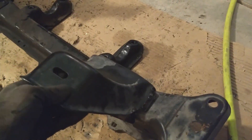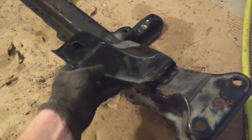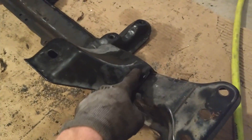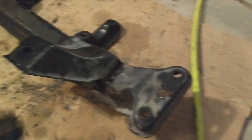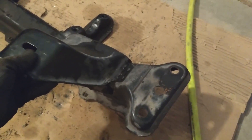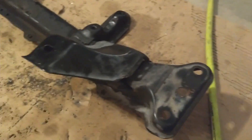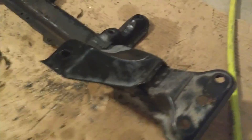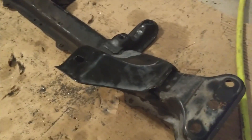However, I might have to modify this. I was hoping I could just flip it around, but if you just flop it around it's going to give you a weird angle. So what I think I'm going to have to do is cut some off of this section right here, and then hopefully get it at the right angle. I may have to do a little bit of test fitting and then do some tack welding, and ultimately just weld the whole thing on there. I think that's actually going to work out pretty good — I've never heard of anybody doing that before, but I think it will work.